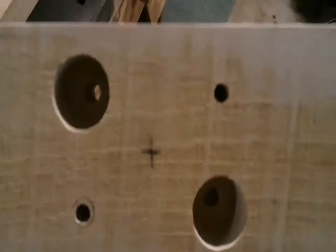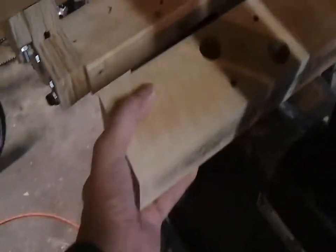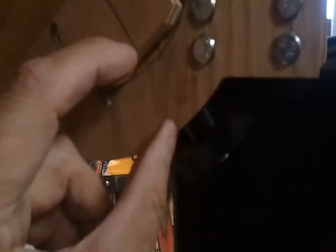The beam with the holes completed, drilled through, hand drilled. And here is the comparison between the previous 2x4 and the new, it's a 3x4. So next, I'm going to rebuild the cradle, making it thicker right here and here. It will start at this thickness. You can also see that I'll probably have to notch out the lumber here if I want to keep the same deck elevation. I'll have to notch out the new beam about here, but it'll be full height out at the ends. I believe Matthias did the same thing.